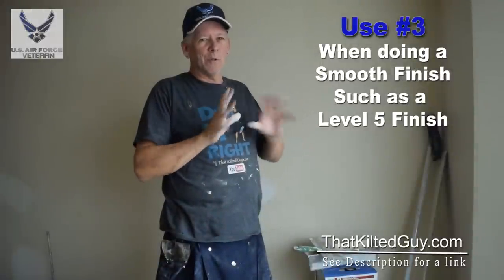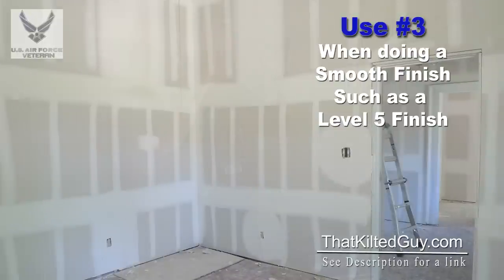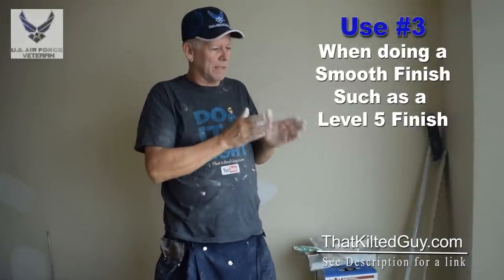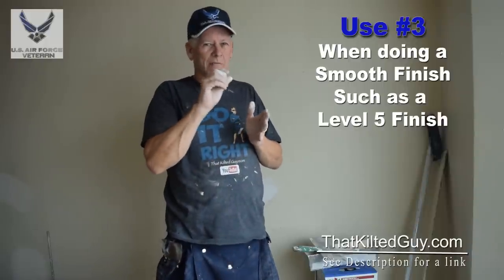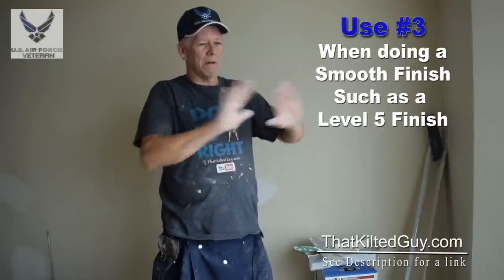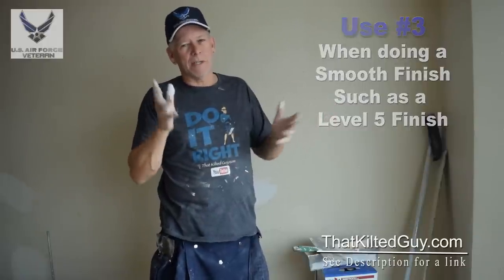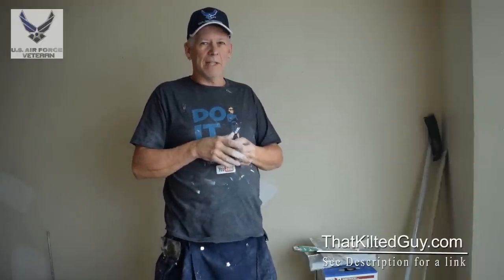If you're doing a smooth wall and you go through and finish all the joints, they look kind of like in this picture — you've got mud here, raw drywall here, mud here, and so on. You can't paint it like that; it will look terrible because the mud sections come out really slick, and the paper sections show the grain of the paper — different textures. So what do you do? You skim coat the whole wall. Now it's all mud, it has the same exact texture. Sand it smooth, touch it up, and you've got a smooth wall.